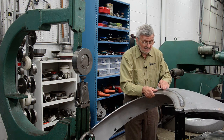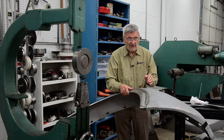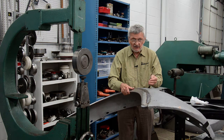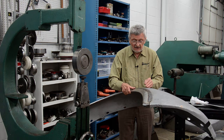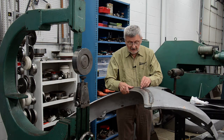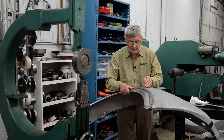This weld reminds me of hot shrinking, which I don't recommend. If you weld two big panels and there are high spots and you use a torch, it's going to anneal the spot, and then the gravity of the big panel on the rollers will push it up. It's very difficult to roll after it's shrunk by torch — that's one of the disadvantages of hot shrinking. If I try to roll crossway, I don't get good results, because that's regular metal — soft spot — while weld is a hard spot. But rolling longways with the weld is okay, because it doesn't change. So you can control it and get good results.